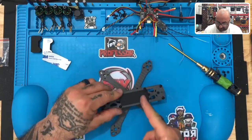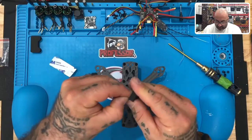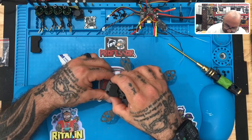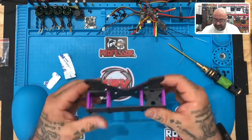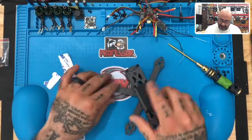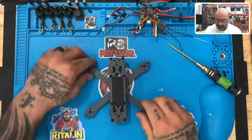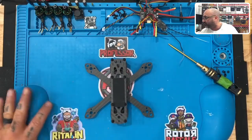You can press it in there or cut it to fit a little better. Then we'll flip the frame over and take our foam pads. It doesn't matter how you angle these, but get them as close to the front and back as possible. These will stick out just a little from the side — normally they'd go on the battery pad on the bottom, but this is a top-flying drone for this build, so we put the pads on the bottom to protect the frame. That's all there is to building the Martian 240 frame. See you in the next step for installing the flight controller.